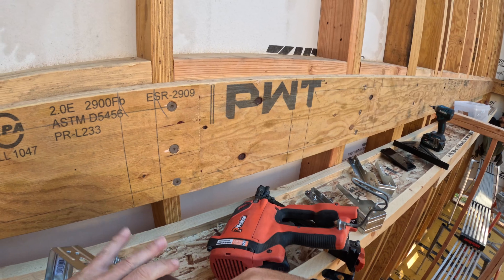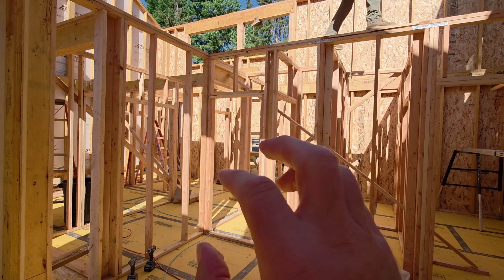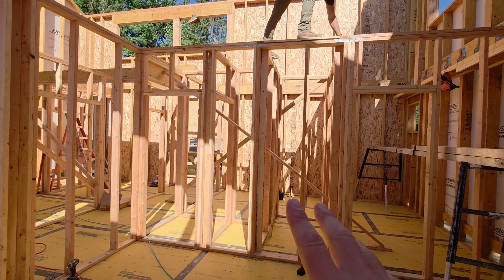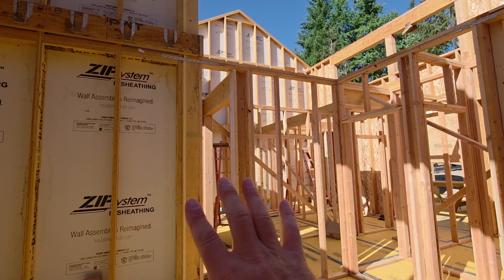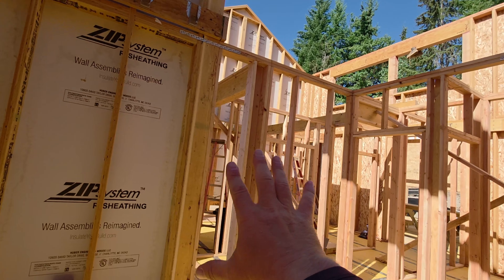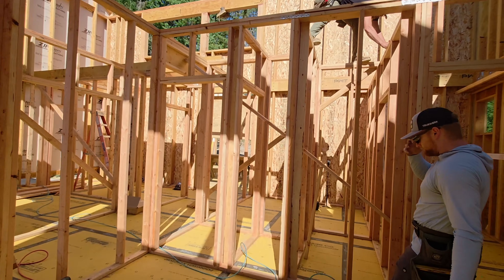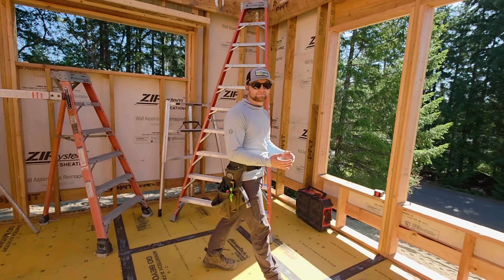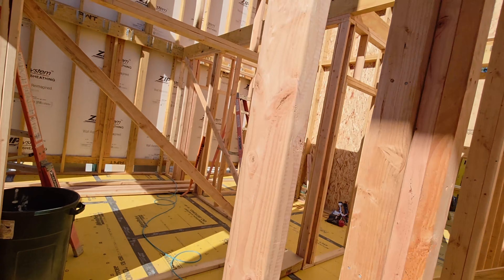Let me show you our approach to bracing. This house lends itself to it a little better — we have very few braces to hold everything straight, plumb, and parallel. Here's a principle: we have a sheathed wall, which means the wall that connects to it does not need a brace, especially if it's plumb. We're connected to that sheathed wall and this one — no brace needed on the hallway. However, we do need to straighten the hallway, and that's what that spring brace is for. But we can walk — Jordan can just walk all the way through. He needs a lot of room for those moves.